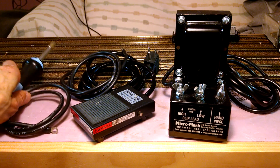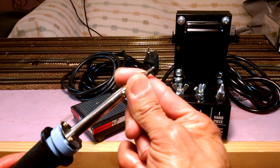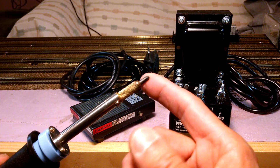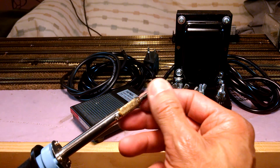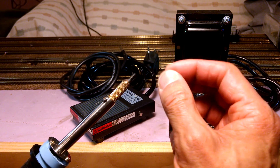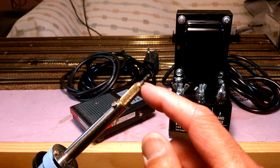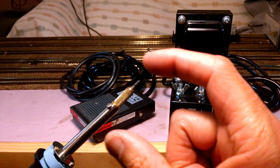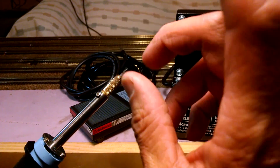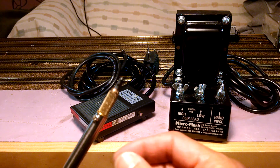I'll give you this word of caution right up front: you're really going to want one of these. This tip acts just like an X-Acto tip. The actual point of contact is not a solid metal — it's more like some kind of densely packed carbon. If you try and press hard like you normally do with a soldering iron, you will break this right where it meets. When you get these in the package, you get seven of them, so be careful when unpacking that you don't break them.